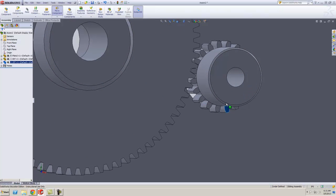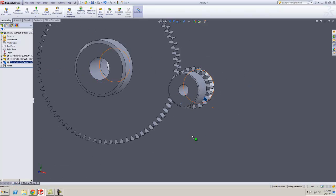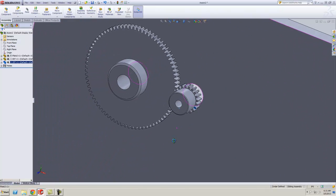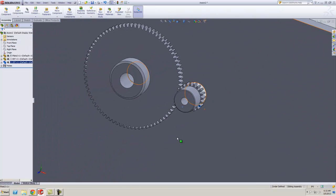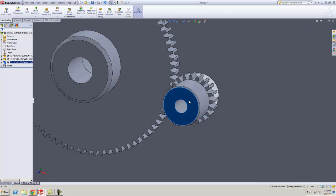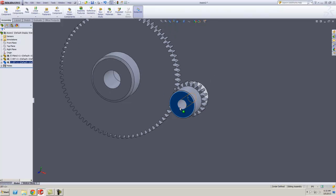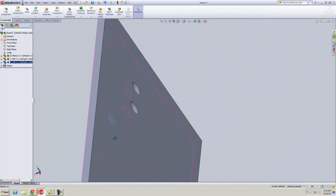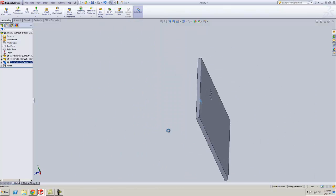See how well that works? That's really not that complicated. So here's your first set of gears in your compound ratio. Right now we're stepping it down. If this is my driver right here, remember, I have 16,000 RPM, so I'm dividing that by 4. I already have that from this gear to this gear, so I've got it down to 4,000 RPM. You have to bring it down to less than 100.